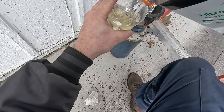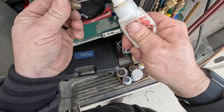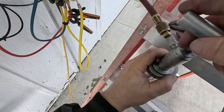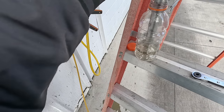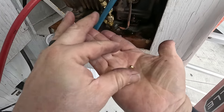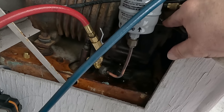And there's a good chance that oil is probably low to begin with. You gotta balance it here. Literally look at this thing — it has done had better lives. We use Loctite 567. This system probably has other leaks — customer understands that. We were supposed to just do a simple startup. So we've got the little short hose on there and we're gonna continue pumping her in. Every time you pull up, it pulls it in — each stroke. She's converted. Now we just pull back on it, get a recharge.